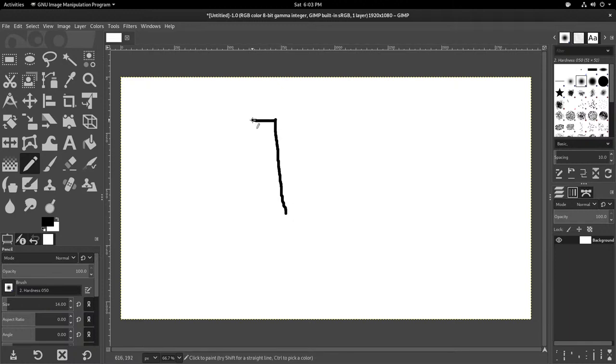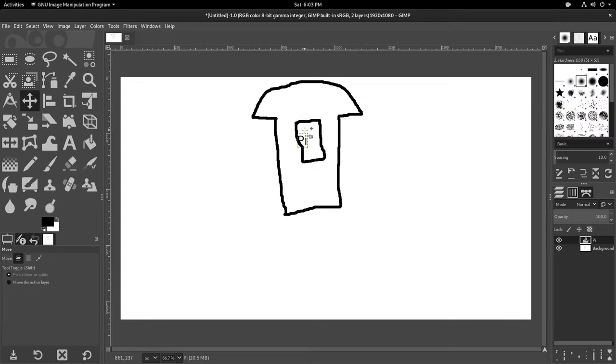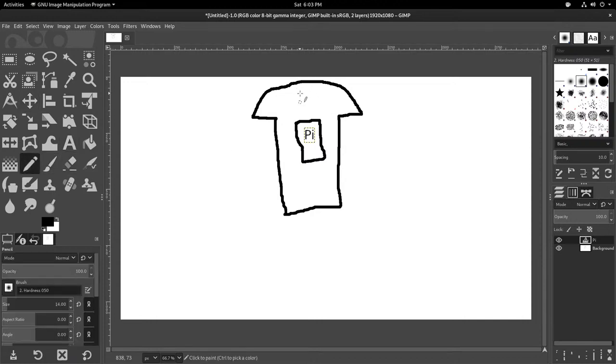The first thing you're going to have is your robot base — you mainly use these acrylic sheet bases. You're going to have your Raspberry Pi roughly in the middle at the front of the robot so the people operating it can see. You're going to have a camera mounted vertically, just looking out forward, and then you connect the camera to the Pi. The Raspberry Pi camera uses a flex cable that connects to a slot on the Pi labeled camera.